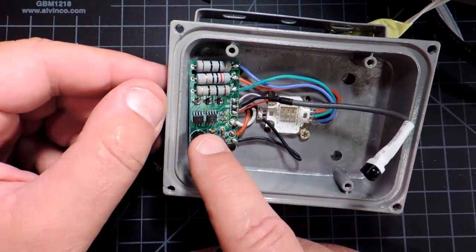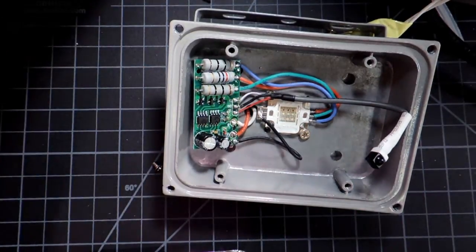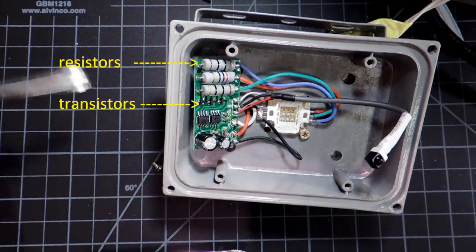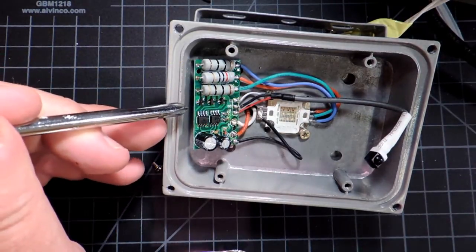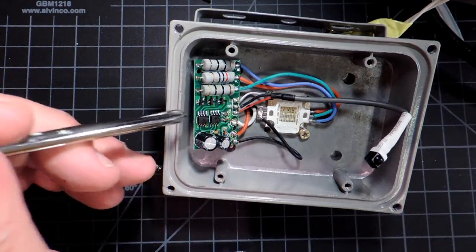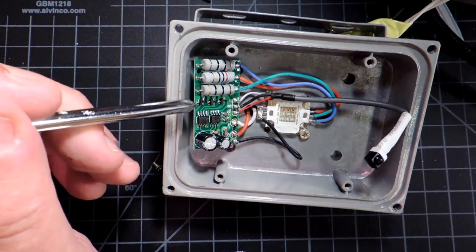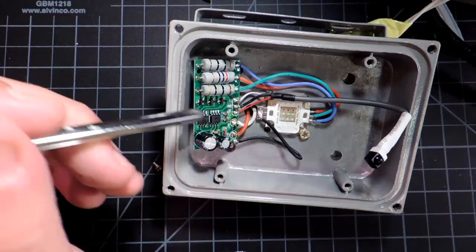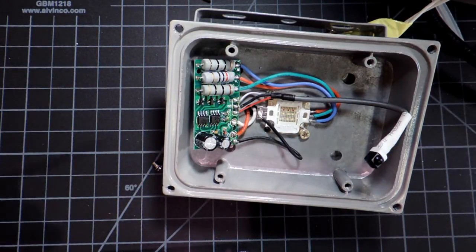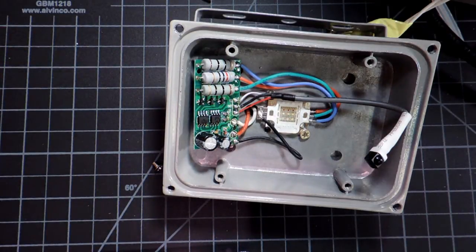There is a controller board in the LED module. If you look at the board, you can see three big power transistors. It's a very trivial design and probably not very power efficient. What happens is, as the driver wants to turn on the LED, it runs it through a load resistor and a transistor to drive the LED. So a little bit of energy is dissipated in the resistors. Then again, this is an effects lighting product, not really a product aimed at high efficiency.